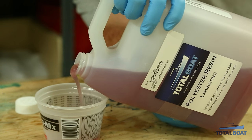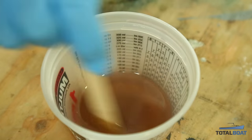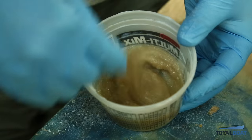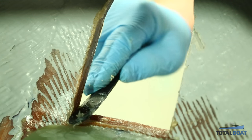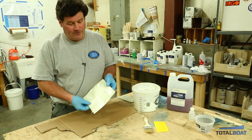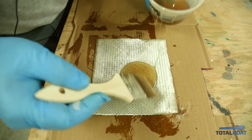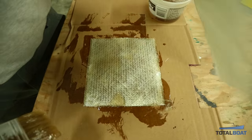The first step is to install the G10 anchor locker shelf. We mix up some polyester laminating resin, add methyl ethyl ketone hardener, and then add silica thickener to create a thick paste. We add that thick paste to the front and back edges, lay the shelf down in place, squish out any extra thickened resin, and clean up the edges with a radiused putty knife to leave a radiused fillet. We then add fiberglass tabbing front and back to glass the shelf in place — two layers of 17-ounce biax top and bottom.